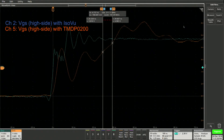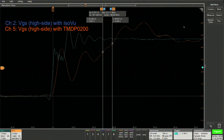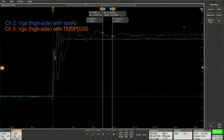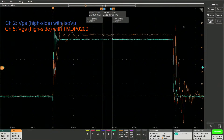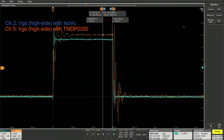That's how it should look — we just don't see it with the differential probe. That's the problem with using differential probes, especially at lower bandwidth. It just slows the signal down, it works as a low-pass filter. Just look at this — even the amount of ringing on the turn-off side is crazy, it's not real. The problem is if you use this system to measure it, you'll try to fix for ringing that isn't even there. So it's a measurement system problem which should not be ignored.